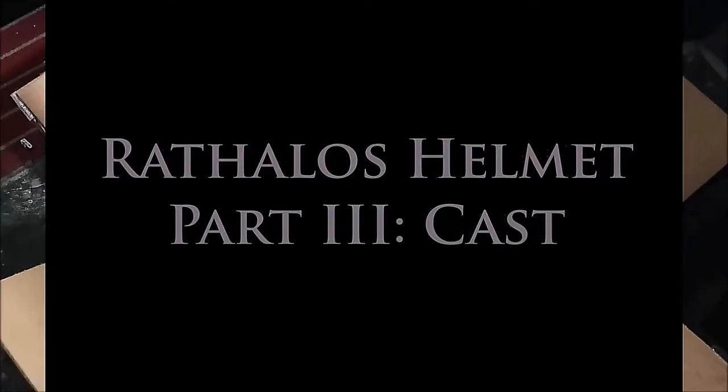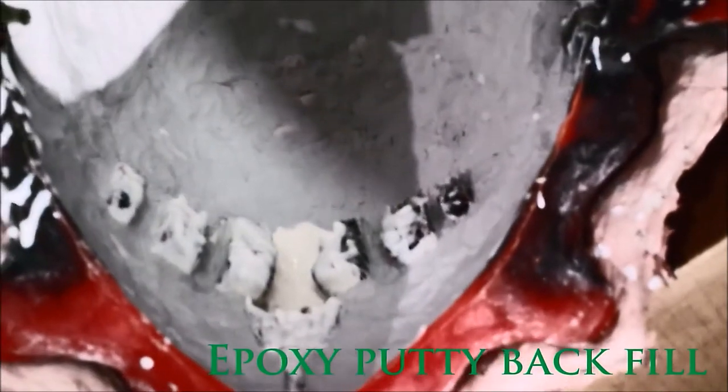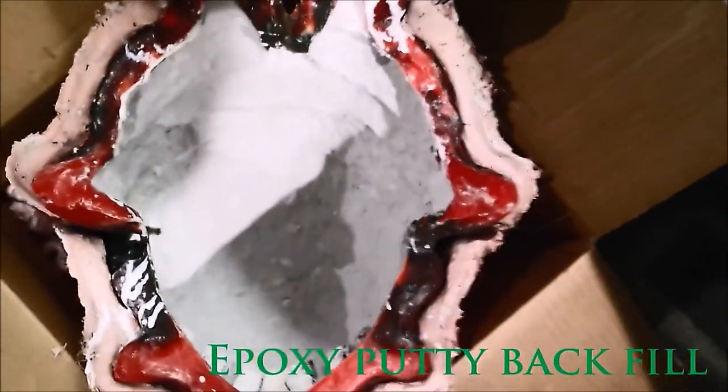It's time to cast. First things first: apply your release agent and brush it around into all of the nooks and crannies. Give it some time to dry before casting. Cast resin and rotate the mold to allow it to flow to as much of the mold as possible for the first coat. Do not brush in the first coat or you run the risk of removing release agent. Repeat this process until you are satisfied with the buildup. For areas that are not conducive to pooling, when the resin gets to a honey-like viscosity, brush or run it over those areas. Backfill the whole thing with epoxy putty and allow adequate time to cure — in this case, this epoxy freeform air cures in about a day.